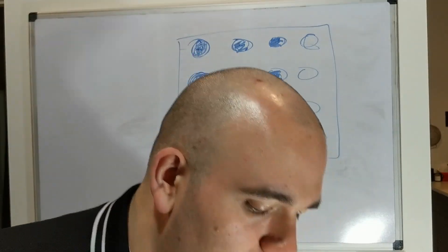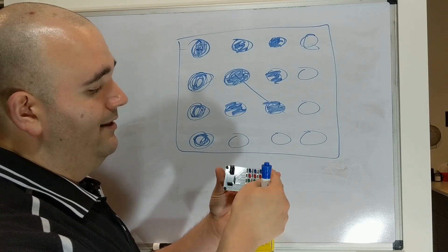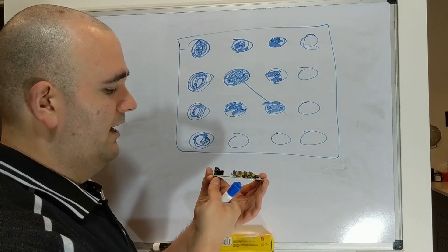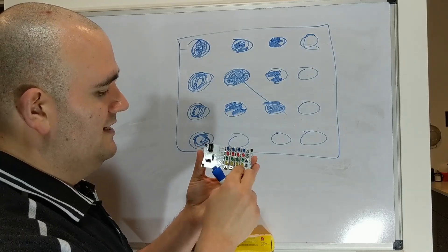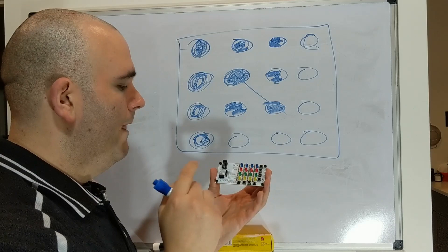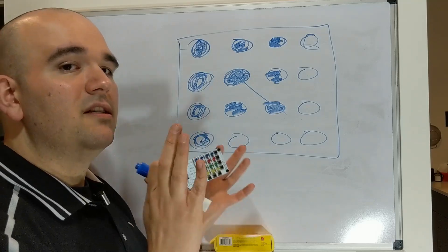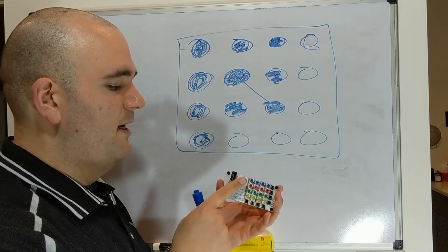Just to make sure you know how to use your board: when you're plugging this into your Arduino, on this side are your positive inputs and they'll correspond to each button. The top input on the header corresponds to the top button. On the bottom side is your ground — this is where you're going to sink the current. If you're using an Arduino, this is where it'll do a digital write low, and each of these corresponds to each LED. So if you run positive voltage here and low voltage here, you'll get that LED to light up. Be careful not to plug in the nine volt battery while you have a microcontroller plugged in — some microcontrollers are sensitive to high voltage spikes from the nine volt battery, so only have one or the other plugged in.